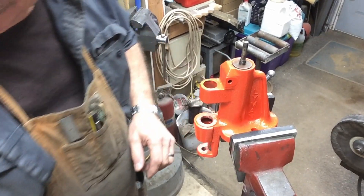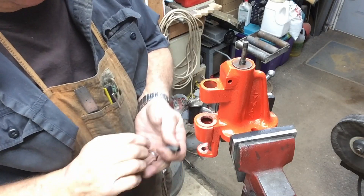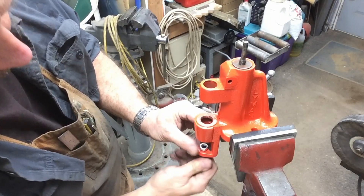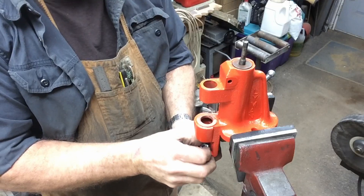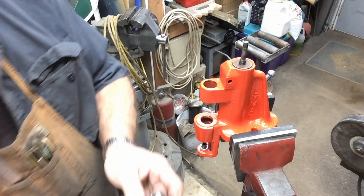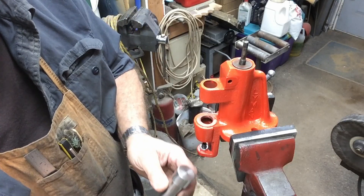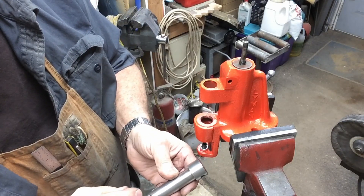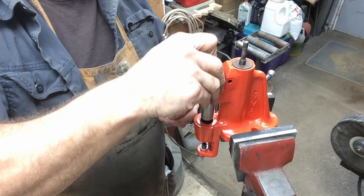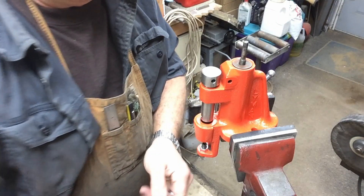Here's our Lubricizer — we had this part already built. We still needed a nut; it's just a standard 5/16. I still have to build the ejector rod that goes down through that. Here's our adjuster with the nut, and here's our ram built out of what I believed was 4140. We've already got it cross-drilled and tapped for the set screw that holds the top punch in place, and it sits in there just like that.